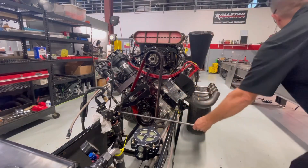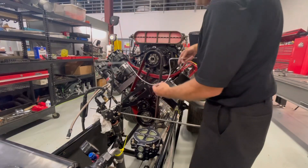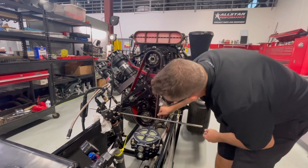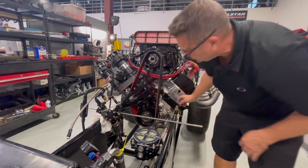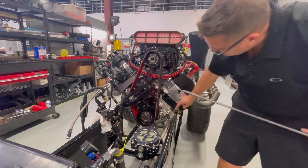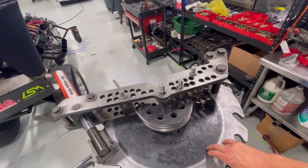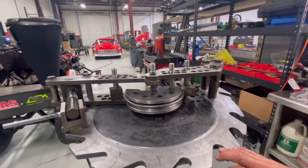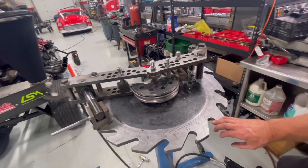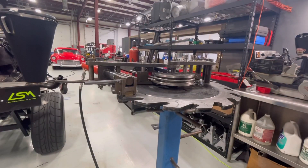In order to make this belt guard, I'm going to go from each side of the chassis and take some 065 half-inch chromoly. I've kind of already made a shape here and I want to make sure it's right — this is going to be the pattern for how I'm going to bend this chromoly to make the support bracket. I don't have half-inch dies for my bender, so I'll just take a bigger die and wrap the half-inch around it. It actually works — you just have to make sure it stays centered in the die or it'll pull the tubing around on an angle and get twisted. A buddy of mine showed me this trick and it works.